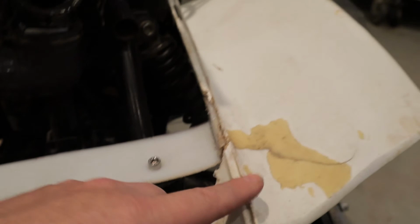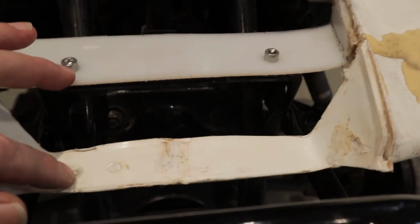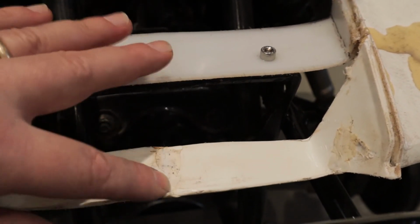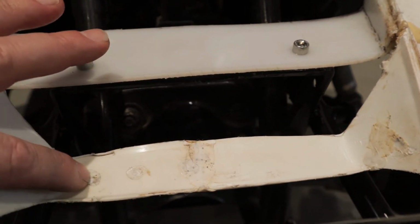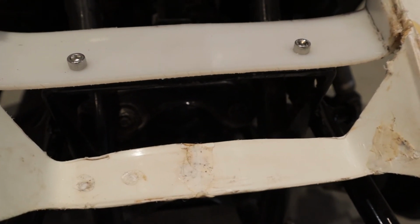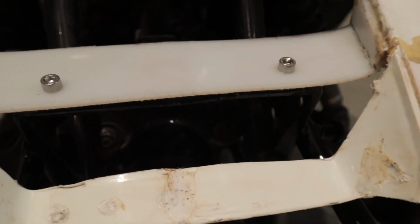Also, the left fender here was spliced together with this one. It was just held together with a series of cable ties, and we actually cut it and then just welded the two pieces together and filled the holes in where the zip ties were with some of the filler rod that we made from pieces that we cut off.